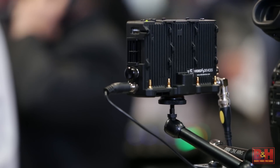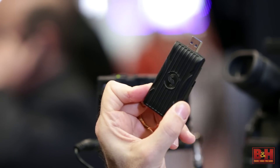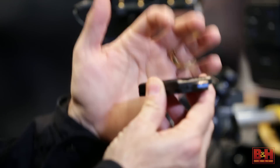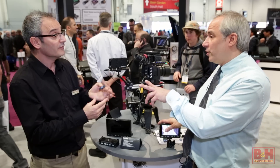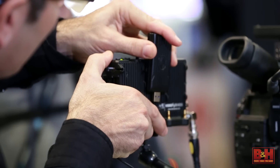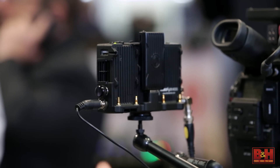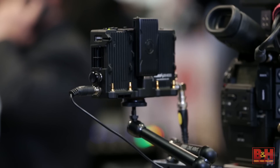The media solution is called the Speed Drive. It looks like a standard USB 3 thumb drive, and it is that, but it's way more. Inside is an industry-standard M-SATA drive, available from anywhere including B&H Photo, and it's faster than USB 3. When you slot it into the PIX-E, it automatically switches from USB 3 to a SATA interface, which enables recording of 4K in ProRes 4444 XQ codec.